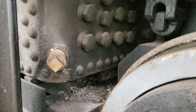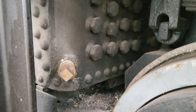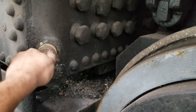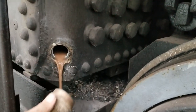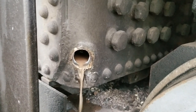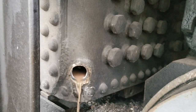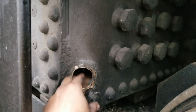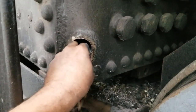If you'll remember from a couple months ago, we did that washout and the boiler was pretty clean at that time, and we only ran it two or three days after that. So let's see what's in the mud ring here after a couple of times operating. Oh, look at that — that's the water treatment still dissolving away the scale and all that's in the boiler. There are chunks of scale in there, so as she was running, breaking away more scale — that's good news.